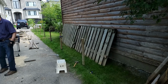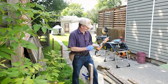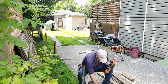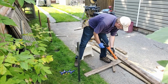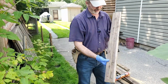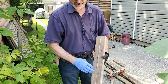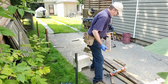Now I'm just going to get them glued in place. I'm just using PL Construction adhesive, designed for outdoors. I just take it. Here we go. And I just run it inside. I didn't show you cutting it, but you get a better look where I cut it, where I told you it comes up. So that's going to be sticking out. I fill that with PL too, so no water can get in behind it. And I'll just fill this bead with PL and then let it dry.